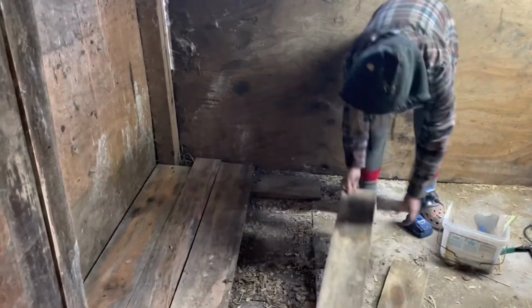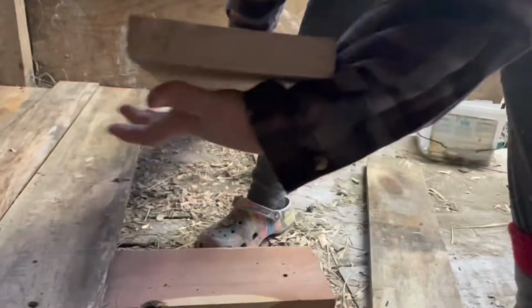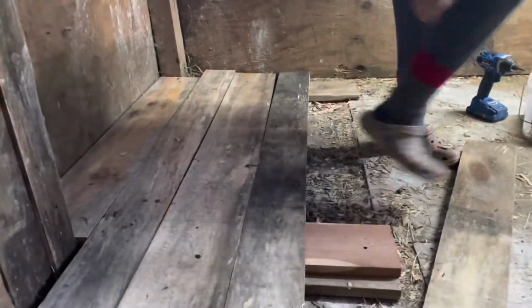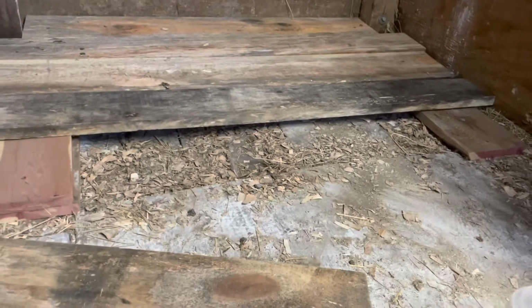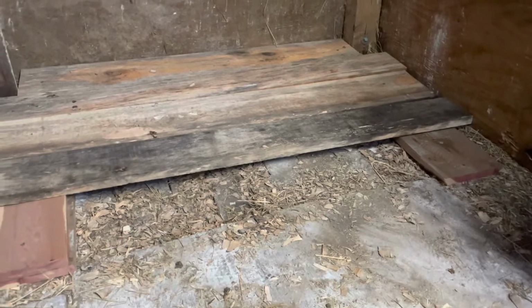And then we got to build the frame to keep mama out so the babies can stay warm. Check the grain. Check the direction of your grain. Is your arch up? There you go. That'll help keep this from rotting faster. I like that this one is going to be up off the ground a little bit. Pigs are generally very clean, but if the babies are silly enough to pee under the heat lamp, it'll leak through and not sit in there and pool on them. So I'm pretty happy about that.